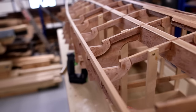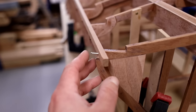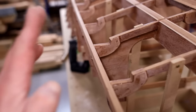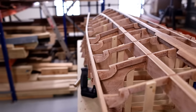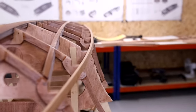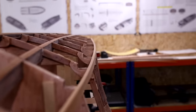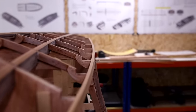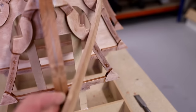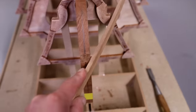We've got that roughly in place and I'm just starting to get it faired in. You can see I've got some pins in place here. The pins are really helpful versus clamps because they allow you to see this outer corner of the chine, and this is what you want to be sighting down just to make sure that everything's fair and there are no high spots, low spots, or flat areas. I'm just starting to spring this in forward now and it's looking fairly good, though there's a little potential flat spot just after that pin there. We're in the position now of just starting to land this down forward and into the stem.